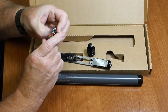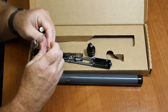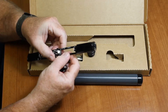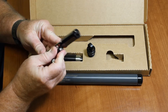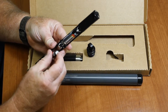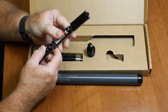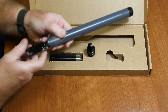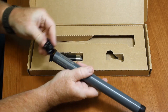The reason we don't ship these devices with the batteries in them is because as soon as you put batteries in them, they begin to advertise their availability via Bluetooth Low Energy. So you don't want it to be transmitting any information when it's in transit — we always recommend taking the batteries out. So we put the batteries in now. This board is fairly delicate, so you want to be careful, observing the plus and minus polarities. Batteries are in place. Install it back into the housing, put our desiccant pack back inside, and screw our cover back on.